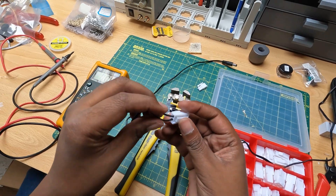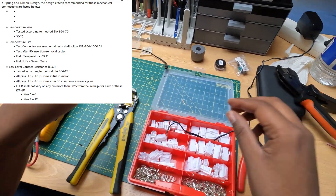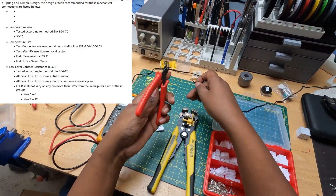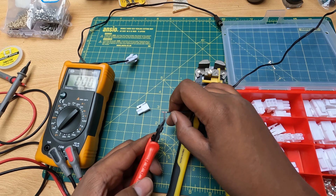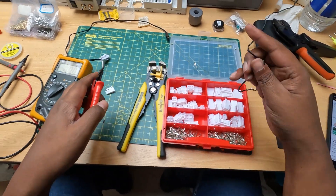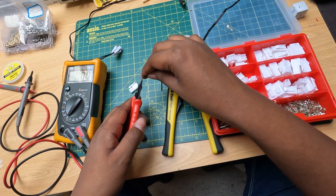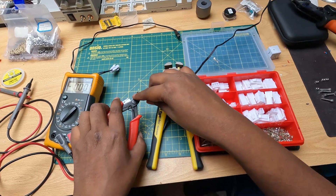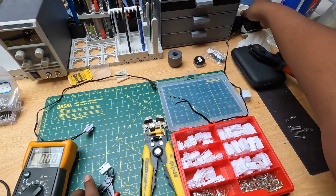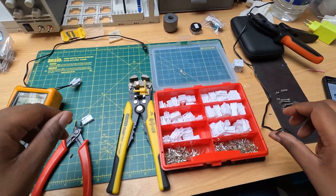Apart from that, there's also some extra testing required. One test already in place is the maximum temperature rise when loading the connector — the maximum rise allowed is 30 degrees Celsius, according to method EIA 364-70. There's also extra testing around the resistance of each pin: it has to be less than 6 milliohms after initial insertion, and also less than 6 milliohms after 30 insertion and removal cycles.